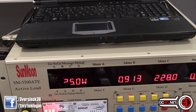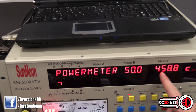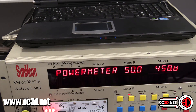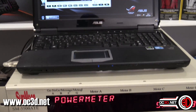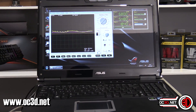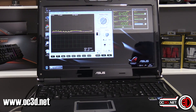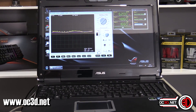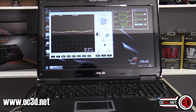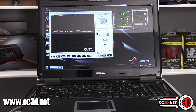With a flick of a switch, we're at 425 watts load — 50%. I've taken a reading of 92.6% efficiency, though it flashes up and down a little bit. For ripple, I took a reading of 6.8, but I've also seen 7.2 there, so I'm going to change my notes to 7.2 since I have seen it.